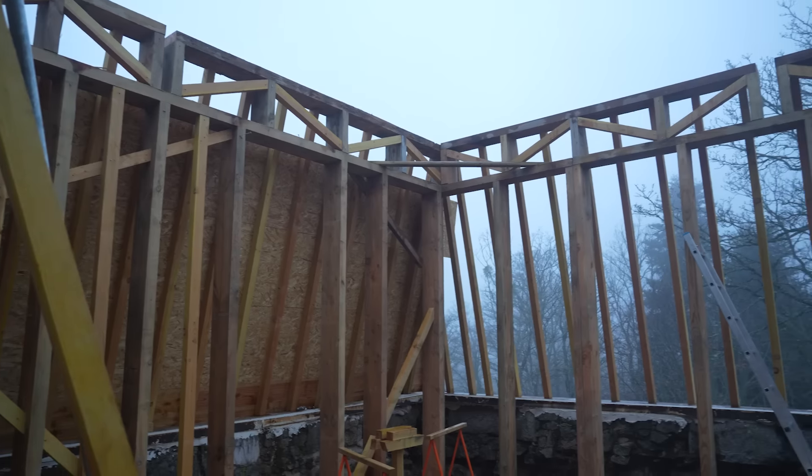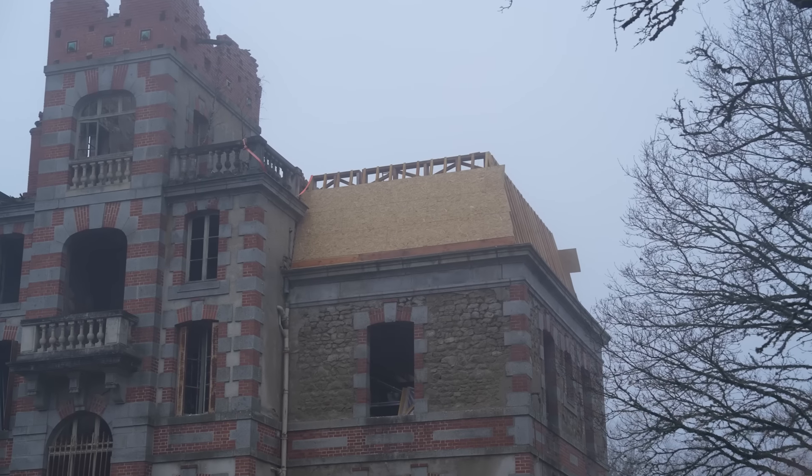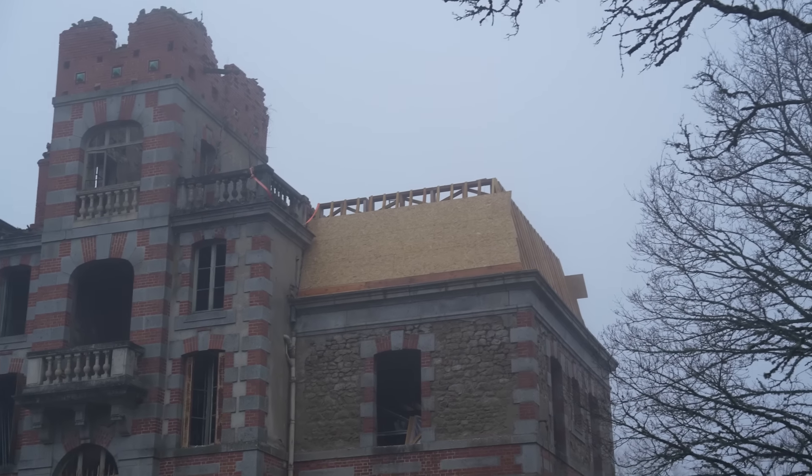It's really really starting to come together. I said you'd be able to see the roof shape. Obviously I've got to trim this edge, and then there's another little bit of board right at the top. So Monday we're going to do the big long side, and then that's all three sides paneled. Hopefully then I can staple or tack some breather membrane on, which will keep the water off the boards just for now until everything's kind of all finished.